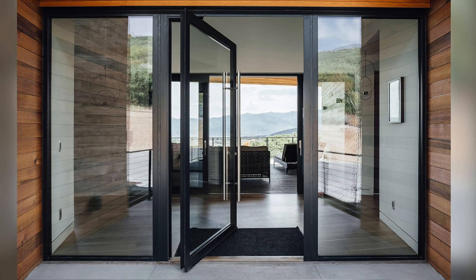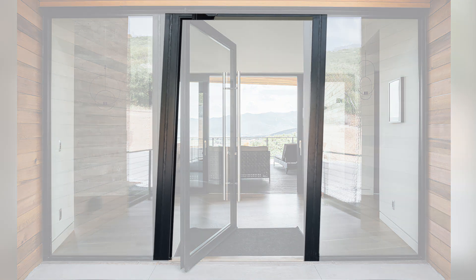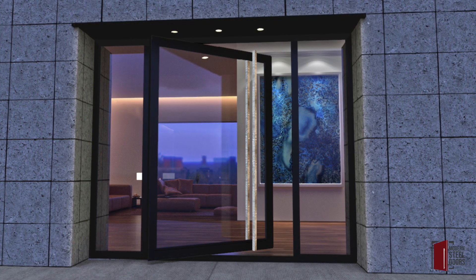This may or may not be important aesthetically; however, the structural difference is clear. Wide pivot doors are more susceptible to sagging. This happens when door joints begin to fail. The door is a heavy moving part, and over time assembled joints will give. The door shape will change from rectangular to parallelogram. With sufficient sagging, the door bottom will rub against the threshold and cause finish damage. A properly welded door will never sag.